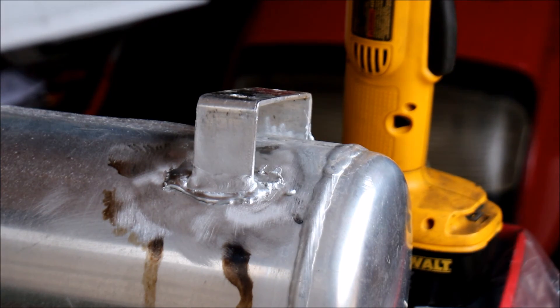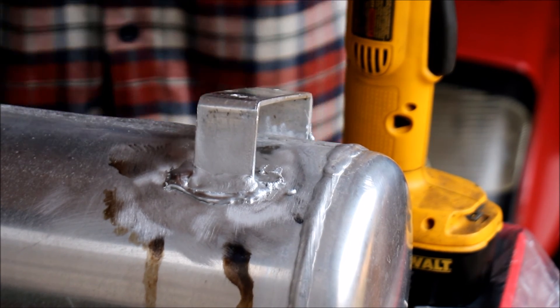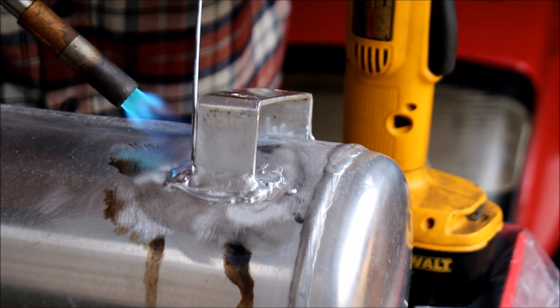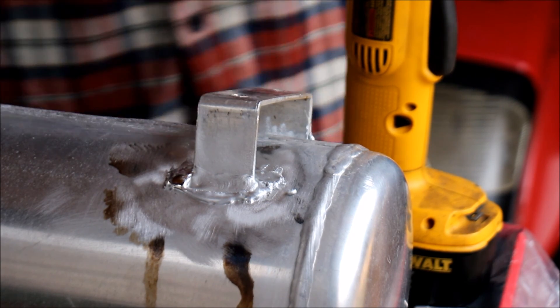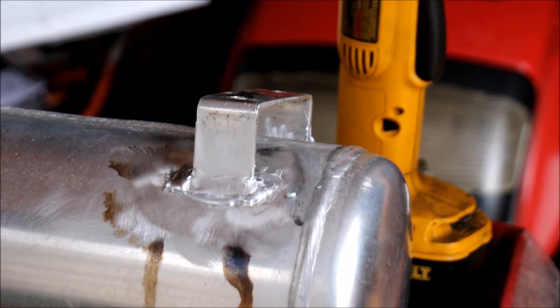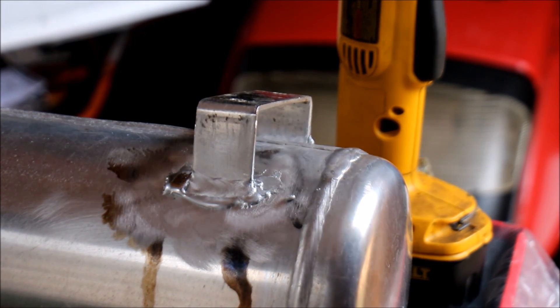Heat the work, not the rod. That's not too bad considering my first time doing this. It looks nice — a nice puddle. It really is best to work with it basically when the heat isn't even on it. Yeah, that'll do. If it leaks a drop I'm not going to be that worried; if it leaks a lot of drops then I'm definitely worried. But I think that's going to be fine. Don't burn yourself. Thanks for watching, don't forget to subscribe.